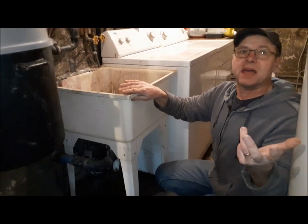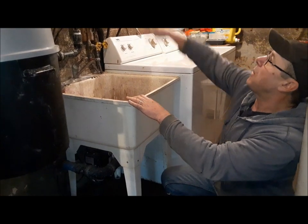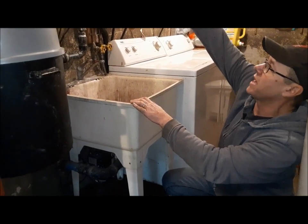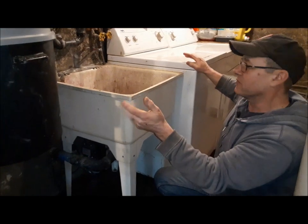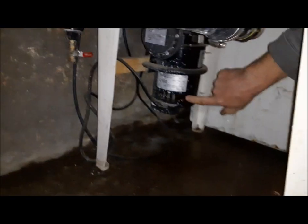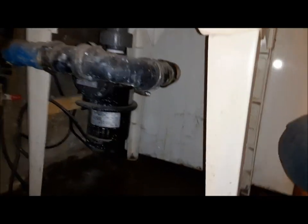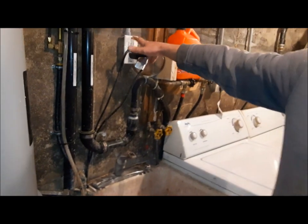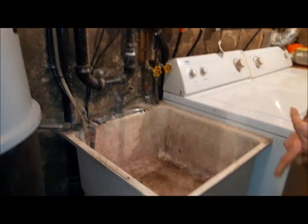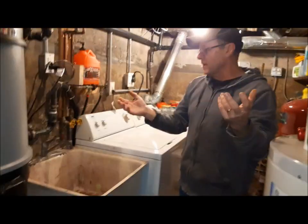The third option — we don't have a bathroom down here, all we've got is this laundry tub. The washing machine pumps itself out to the septic line so we don't have to worry about that. This laundry tub has a pump with a third-horsepower motor underneath it that pumps the drain up to septic height. Unfortunately it keeps tripping the GFCI because the seal in the pump is gone and water is leaking down the pump shaft right into the electric motor and shorting everything out.